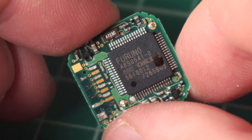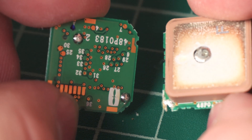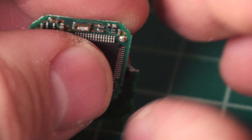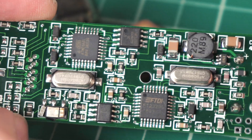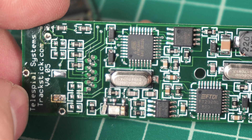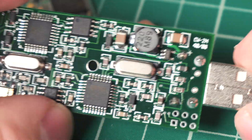Yeah, it's the ARM-based main controller — pretty interesting. I like the design of stacking multiple PCBs to keep the footprint small. A lot of the GPS units I have are separate — GPS controller with a separate ceramic antenna — I've never opened one up, so maybe this is common. There's not too much on this thing other than the microcontroller, the USB controller, and the GPS unit, but they've managed to shrink quite a bit into it. There's also a little LED for status. I don't really have a use for it even if it was working — I'd probably just end up attaching it to one of my cats to see that they don't leave the house.